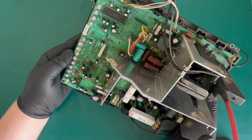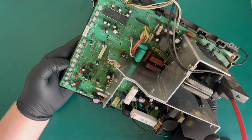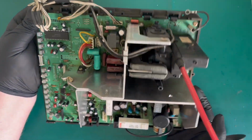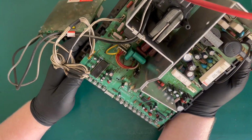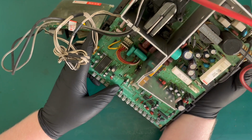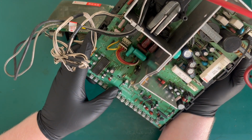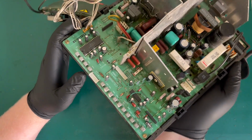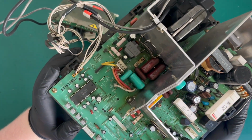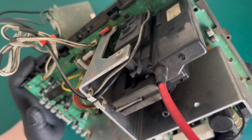And I've got another MS9 to do as well. So it'd be interesting to see how that compares, which is why I want to audit this one properly. If we have a little look, we've got the Nanao main PCB number here, and on this particular one it's 05A00675C2. And yeah, like I say, I think most of these are Nichicon caps. I'm wondering if anything is actually original other than the filter cap.